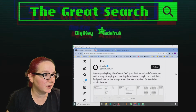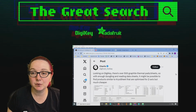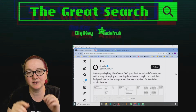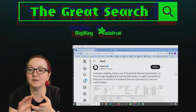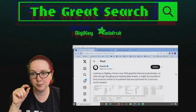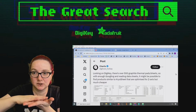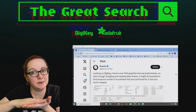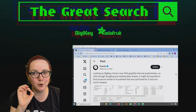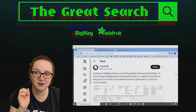And so apparently there's this other kind of material called thermal pads. I've always used paste, but I have seen thermal pads once in a while. Thermal pads are, as you can imagine, very thin pieces of material, and they're less messy than paste. You never have to clean it off. You stick it on, remove it. And they have a benefit: they can also be a gap filler. One of the risks of clamping the heatsink onto the CPU is that if you clamp a little bit too hard, you could crack the CPU. You want it to be exact, no more, no less. Too big, not enough thermal transfer. Too little, you just destroyed your CPU, and that's really tragic.